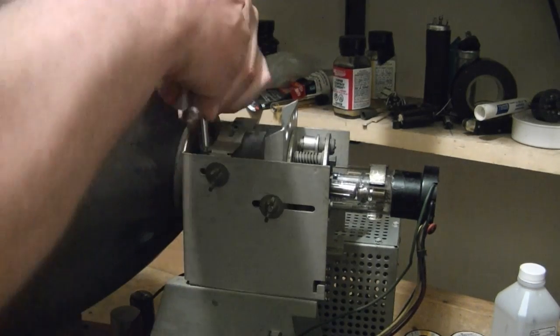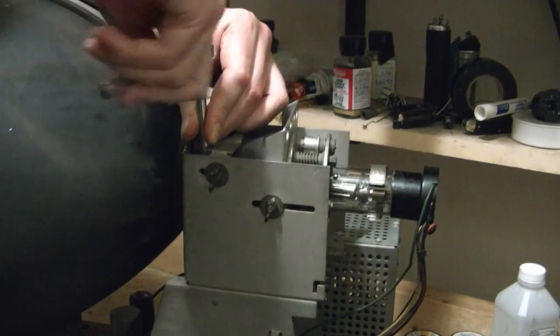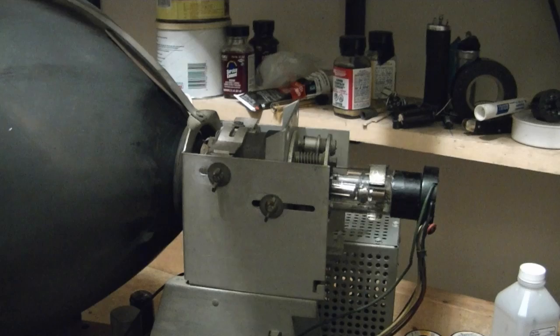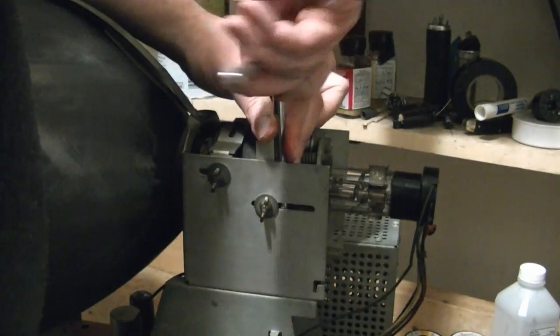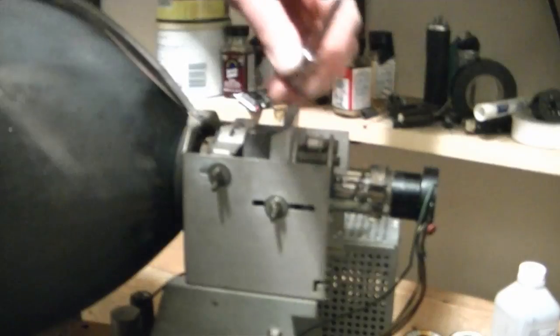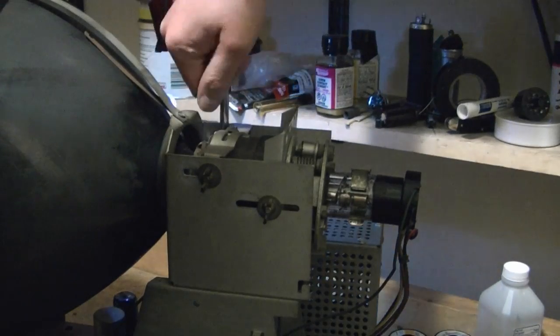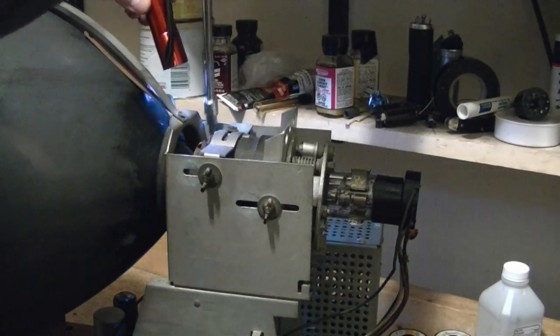Alright. Loosen up. This makes me wonder, because there was a 17BP4 in here, which is exactly what I'm replacing with. So what I took out was a rebuild, and when they rebuilt it, the dimensions might have changed slightly, and I'm sure from manufacturer to manufacturer there was some slight variation. You look at the dimensions on CRT data, they give it like plus minus ½ inch, 1/4 inch, whatever. But also, this thing might have originally had a 16-inch picture tube in it, or was originally designed for a 16-inch, and who knows if it was ever properly tweaked to hold it.